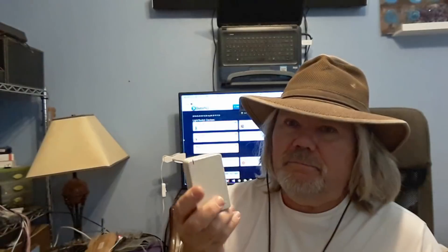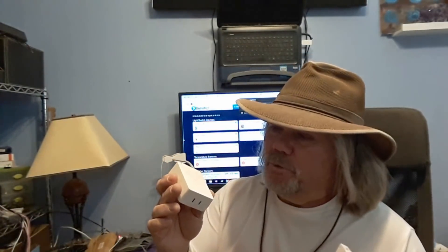What I really like about Insteon is whenever I'm doing some lighting around the house — I started out using these at the church to control the LED lighting there. What I really like about it is it gives the lighting a very organic feel, because LEDs are instantly on and instantly off. But with these, you can give them a ramp up and a ramp down when they turn on or off, which gives it a nicer, warmer feel.